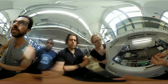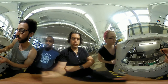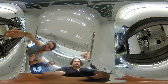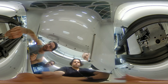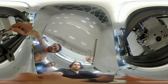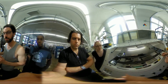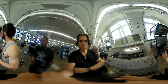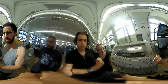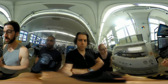This is just a brush with a little bit of Superior 75 flux dipped onto the bristles. I'm going to very lightly coat the top of the nozzle, clicking it a little bit all around — you want to have 360 degrees of coverage. This is going to ensure that my wave is nice and stable when I run the entire board. We were down for a bit, so the pot is still heating up and there are probably some minor contaminants down in that nozzle right now. So we have to wait for it to heat up. Once it's all nice and hot, we can run our board.